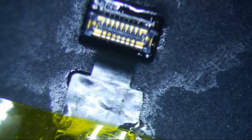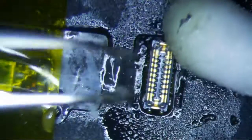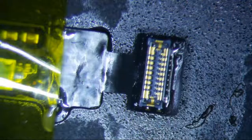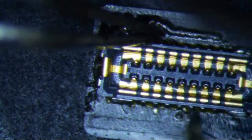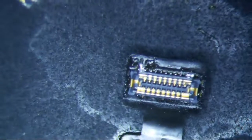That's pretty much good. Let's clean it up with IPA and check it out. I'll probably diode mode it after I'm completely done, just to make sure — I don't think he sent the phone with it. Let's double check these joints and make sure they're all shiny and not weak. Yeah, this is all good — I don't see any bridges or anything. Other side looks pretty good too. All looks good, I think that's pretty much a day.